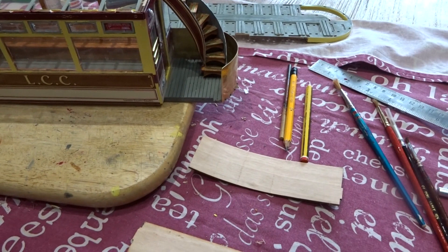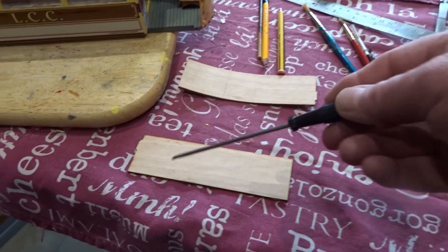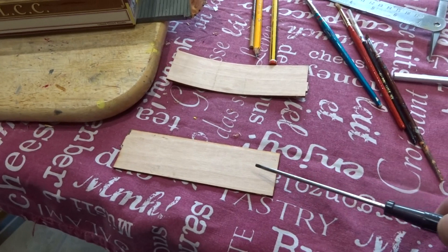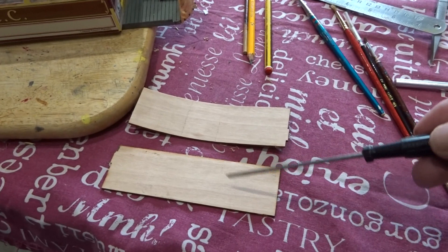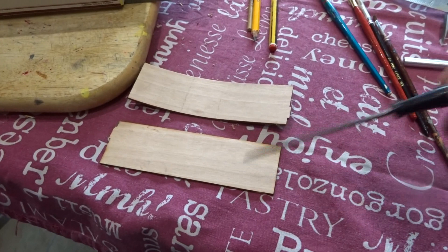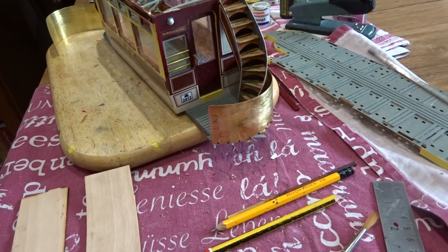It hasn't been possible to do that. They tell you to soak this wood, but the reason it doesn't work is that the grain of the ply runs the wrong way, so there's tremendous resistance to bending. This one was soaked overnight and it just wants to straighten itself out. If you needed to bend this wood, the plywood should have been laminated so the grain ran the other way on both sides. To cut a long story short, I've given up on the plywood ends and instead cut out two bits of brass to do the end plates.